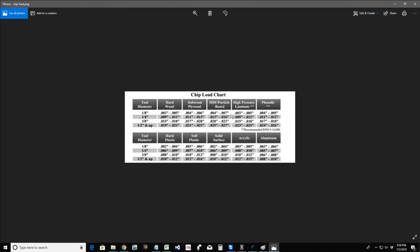So just use this as a suggestion, but don't say, oh geez, if my bit says that I've got to run 560 inches a minute and I can't get up that high, so I'm not getting the optimal feed rate, what do I do? Don't call me with those questions. This is just a suggestion. Get as close as you can. Set your RPMs appropriately. Get in a good range where you're making chips.